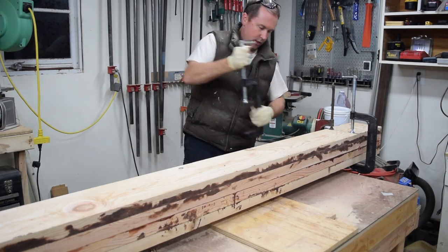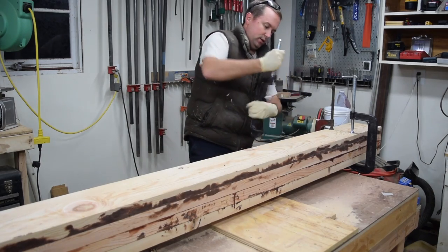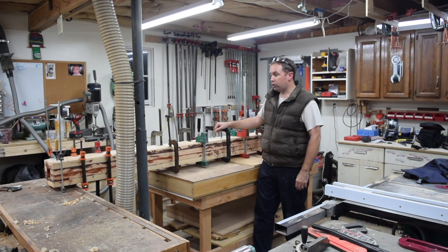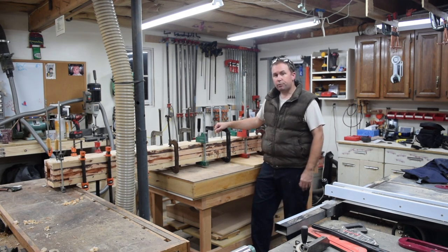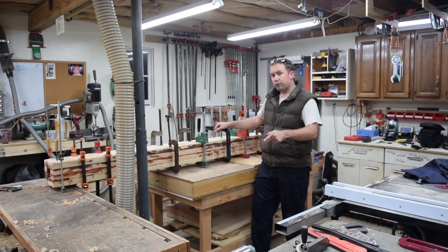There's an old saying in woodworking: he who dies with the most clamps wins. It's my goal to win. So glue-up is complete. We used about seven or eight ounces of the Resorcinol glue. Obviously we've got a lot of clamps at high pressure — that's what this glue requires. No major problems, went pretty smooth. Next time we'll probably be working on some of the other keel components like the knee and the stem — those patterns are ready to go.